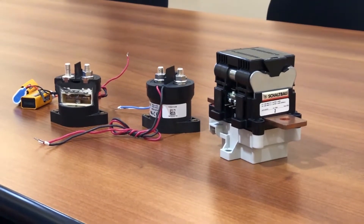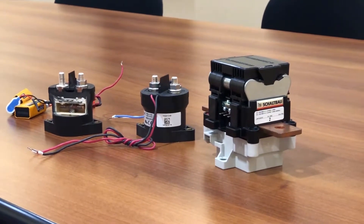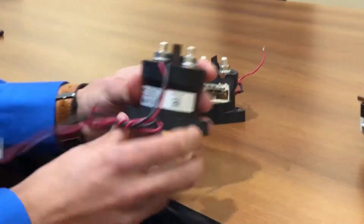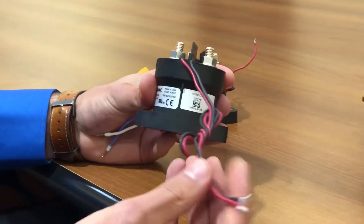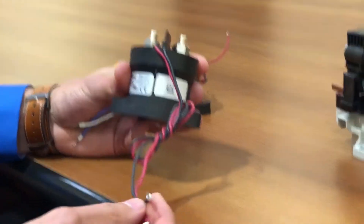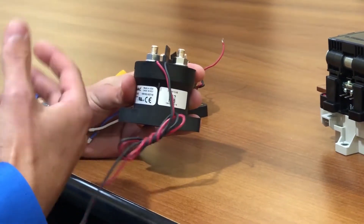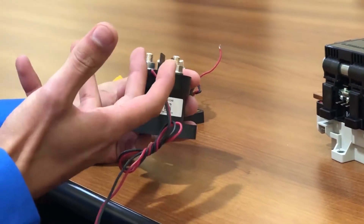Connecting and disconnecting the stack — so how does the contactor do that? The contactor works with a coil. You have two leads here that are expecting a voltage — in this case, a 24-volt signal. What that does is it energizes a coil within the contactor, and that coil creates a magnetic field that closes the contact.